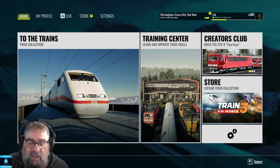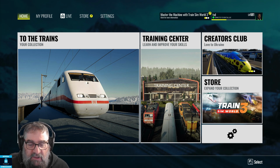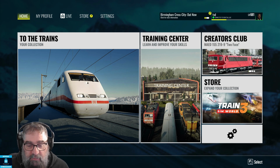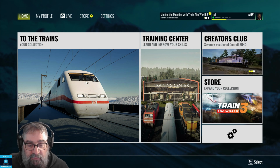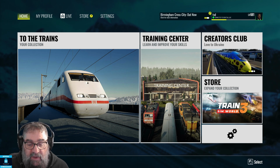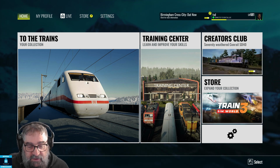Why do some brakes have lap and others don't? Well, really they all do, but some of them have a clever little valve that replaces the lap handle position. Basically, these ones work by providing a range of braking from none to whoa, chuck out the anchors, mate. When the driver moves the handle and stops it at a given point, the clever valve changes the pressure being applied and then holds it until the driver moves the handle again, either to reduce or add more pressure. From our simple viewpoint, this is the same regardless of air brakes or vacuum brakes. These are the easiest brakes to use.